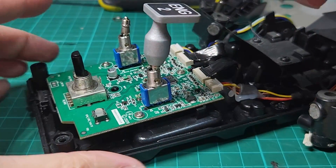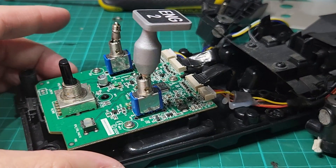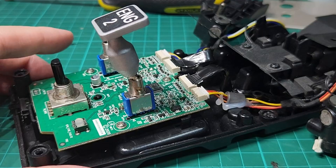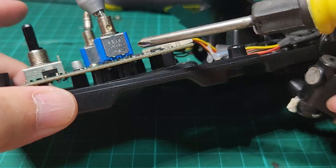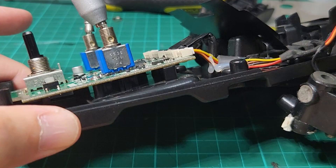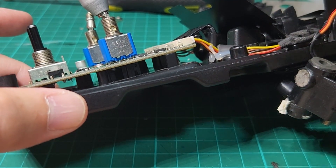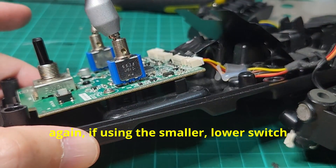With the new bigger handle and the new feature, the force is no longer just up and down but also lift up and flip. Without any other support, everything attached to the switch is only held by the three pins soldered on the circuit board, which means that after some time of applying force you will weaken the pins and eventually lose the contacts, and also make the switch a bit wiggly.